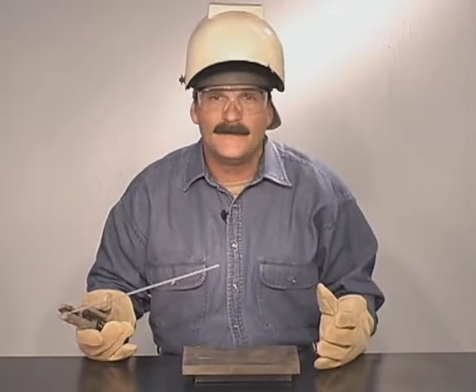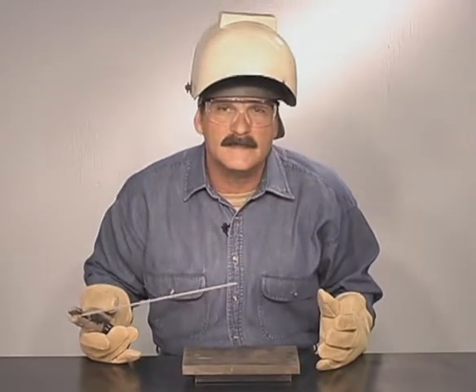Cover yourself up, wear some good gloves, a hat, keep clean lenses in your welding hood, and always wear safety glasses. Before you light the rod, get comfortable. Scratch to light the arc. Bring the rod back and start the puddle. Maintain a uniform arc gap with the amperage set high enough to let the puddle spread out.